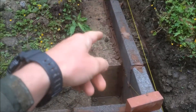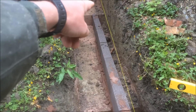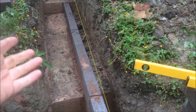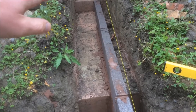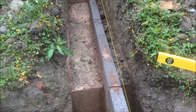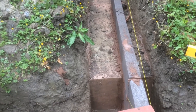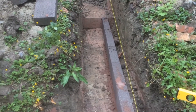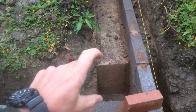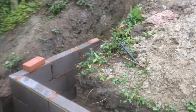This course of blocks here needed quite a thick bedding of mortar along the bottom, but it just about meets up with the next step along at the correct height. That saved a lot of cutting — otherwise I might have had to put two courses of bricks in there. Making steps the right height is quite quick, but cutting lots of blocks to fit is a long job. As you can see, we've got different size steps: a two-blocker here, a one-blocker there, and a two-blocker there.